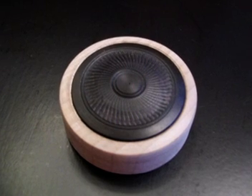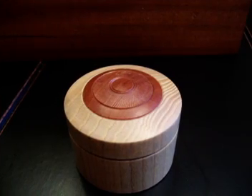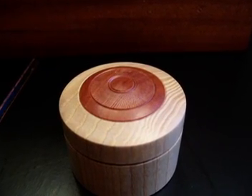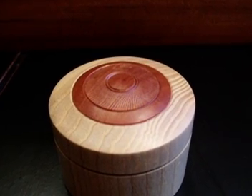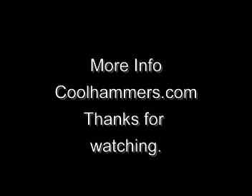With a little Renaissance wax, shined it up — looks pretty good. I know some of the detail is hard to see, so I took some snapshots to give you an idea of what that work actually turned out to be. On this very last sequence, that is how you prepare the disc — in this case ebony — to go into a top as an insert. You have to turn it around, then glue the maple top onto it. And if this were a real project, that's what we would have done.